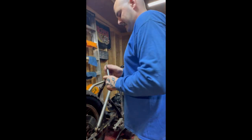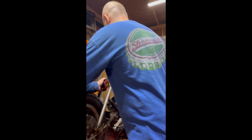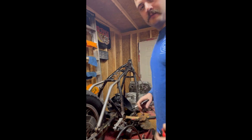So I'll take that back out. Find my Sharpie. And now, like I said, we're looking for 4 3/4. Come up here and mark 4 3/4. And the same on this side. Come up here and mark 4 3/4. So now I've got my two lines that I know I can set that up to.